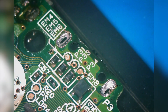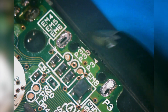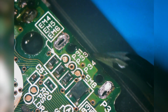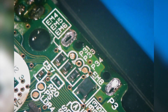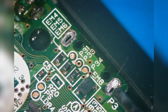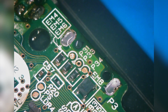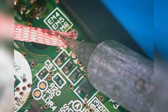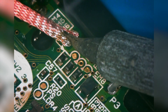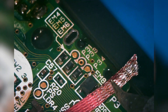We got the port out. This will be a lot easier with low melt solder, but we're working with what we have. So here's what we're going to do next — we're going to add a little bit more flux, then we're going to use some solder wick and get rid of all of that extra solder. My iron is at the same temperature as before, 370. We're going to come in and absorb all of that extra solder, and we should have some nice clean joints and clean vias.